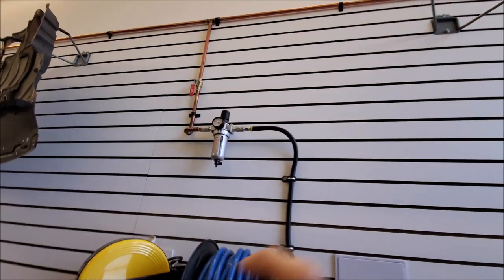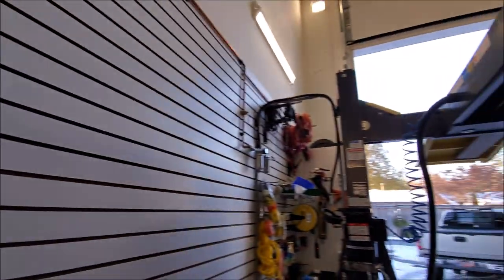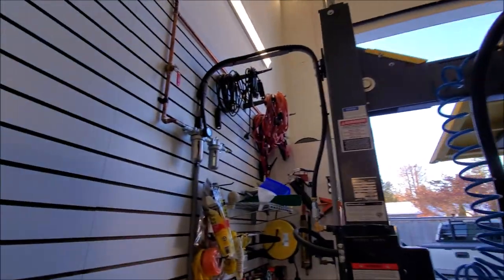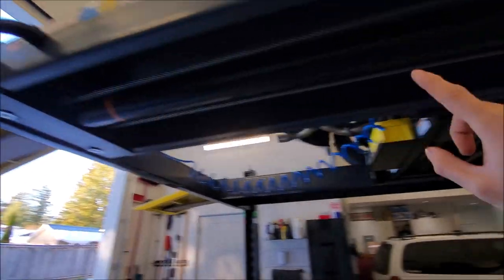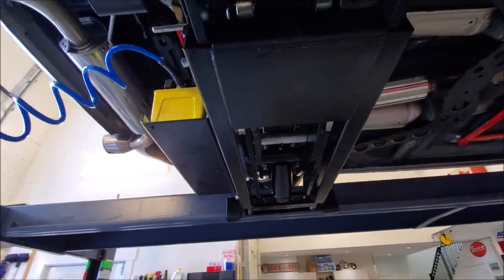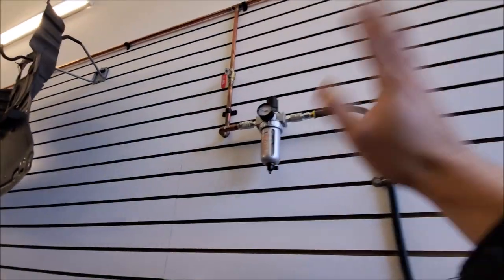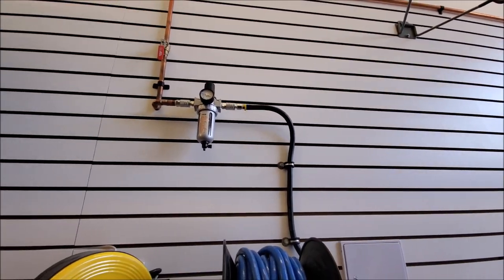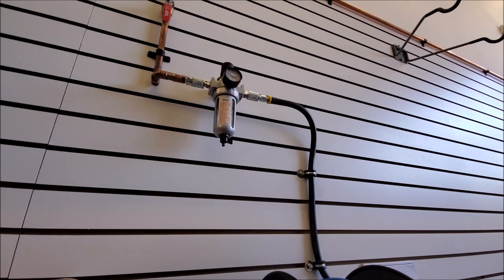The air pressure at each outlet might be a little different, but we have to stay within parameters — we don't want to throw too much PSI at the tools or the lift, so check your owner's manual. I also have an oiler on this one, but it only services the hoist, not the general tools. As we run the jacks or locks, they get a little oil so everything lasts longer. For the other outlets I don't run an oiler, because if you're blowing something off or running a paint gun you don't want oil — I'll apply oil individually to air tools as needed.